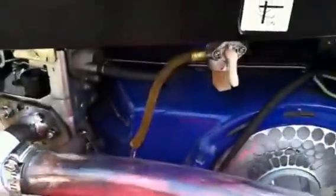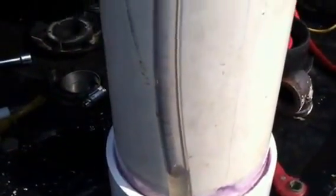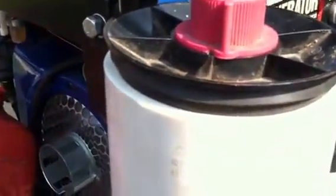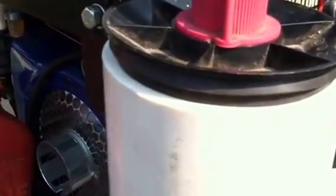When I'm done with all that testing, I'm gonna hook it up to this. This is not where the gas level is gonna be — I don't know where two to four cups would be yet. But I built this today and it has a copper tube going down the center because the other PVC was getting soft in the gas. There's an air stone down there, it's baffled, and it's gonna be hooked up over here. Then I'll put whatever's in there and run the generator and time that.